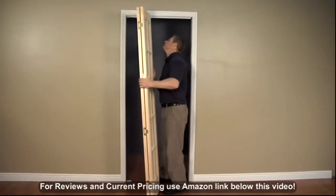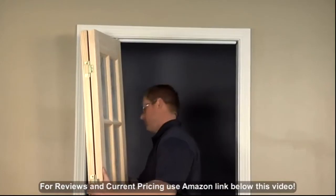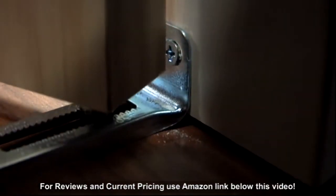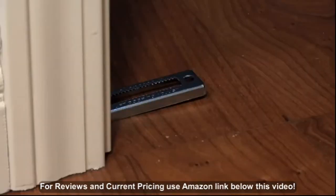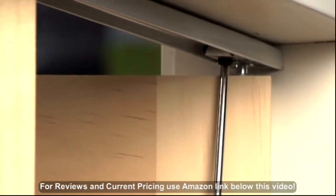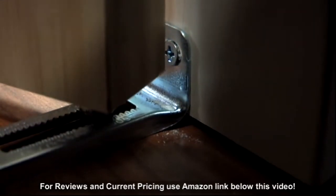Install the door panels by inserting the top pivot at the pivoting side of the door into the track bracket. Depress the guide pivot and position it under the track, then release it so the guide pivot is securely positioned in the track. With the top pivots inserted, lift upward on the panels and position the bottom pivot into the jamb bracket on the floor. Let the bottom pivot sit onto the jamb bracket firmly with the knurled teeth engaged. The door height can be adjusted by slightly lifting the panels and turning the threaded stem of the bottom pivot. You should seat the bottom pivot into the jamb bracket at the desired height. Be sure the door is plumb with your opening and not rubbing against the door jamb. You may also need to adjust the track brackets by loosening the bracket screw and sliding the bracket within the track. Be sure to tighten it at your desired location. You can also adjust the door closer to or farther away from the jamb as necessary by moving the bottom pivot in either direction.